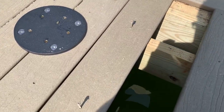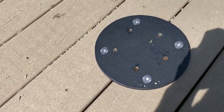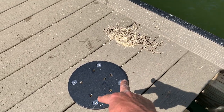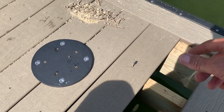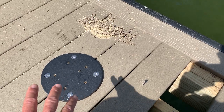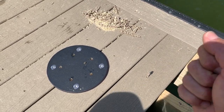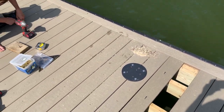We took up a couple deck boards and laid this one back down. We installed a two-by-ten running between the floor joists here. The bolts go all the way through to another plate on the bottom. We used four three-and-a-half-inch deck screws through each joist into our two-by-ten, then run those four bolts down and bolt that plate on the bottom — giving you a really sturdy base.